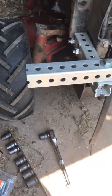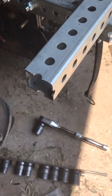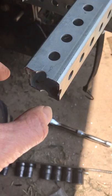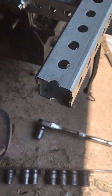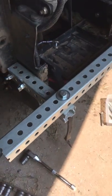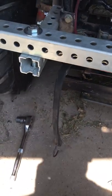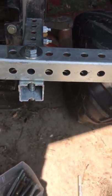For those that don't know, this perforated steel is made by a company out in Colorado. It's available in one and a half inch — this is one and a half inch outside diameter. Then there's one and a quarter inch, and then there's one inch. The one and a quarter inch fits and slides inside of this one, and the one inch slides inside the one and a quarter. So once this is welded, I'll take the bolts out and I basically have a front attachment apparatus.